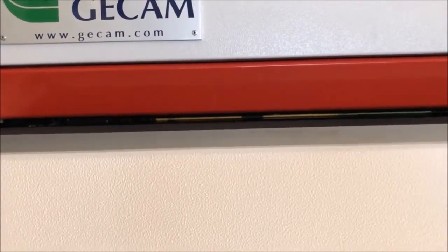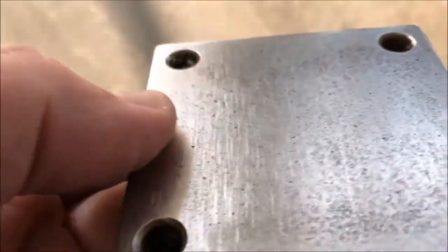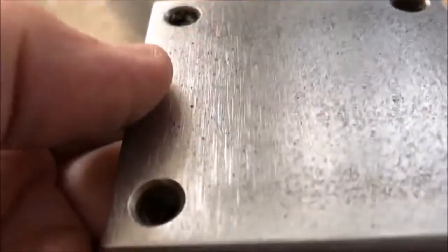Now it's going to the cross brushes, but you see it holding there also, very nice. By the way, we are running 80 inches a minute, so that we get a good amount of edge rounding. And then we look at the part as it comes out the back. So, this is a mill scale part. This is exactly what I wanted to see. But with the first belt, we didn't remove enough of the mill scale.